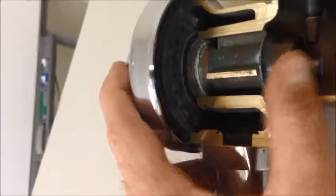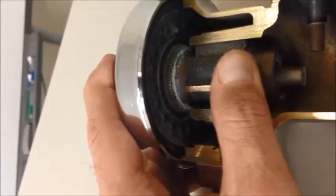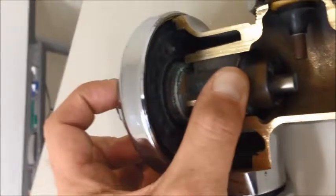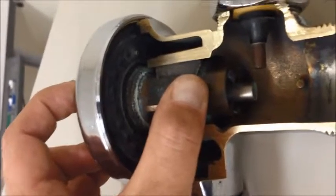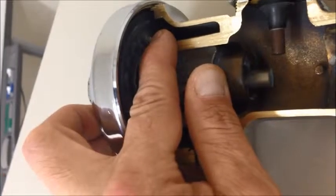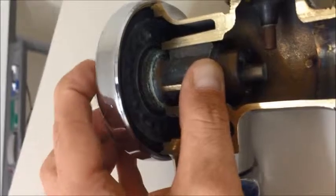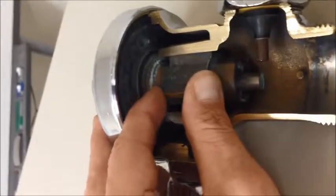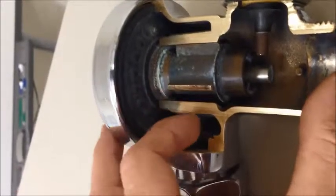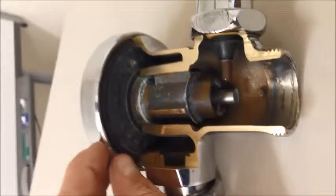All of the pressure dumps up from the top down. With that, the water pressure coming in here will raise that diaphragm up, and you can see that the water can now escape and go straight down into the water closet, urinal, bedpan washer, what have you. At the same time, it's going to be filtering through this hole to fill up this top chamber. And as that chamber fills up, it's going to reseat as soon as it equalizes on pressure — the pressure from here equal to that — but there's more surface area on the top. And that's how the flush valve works.